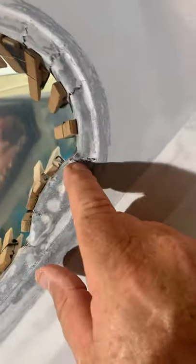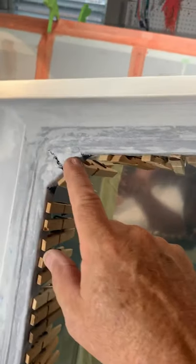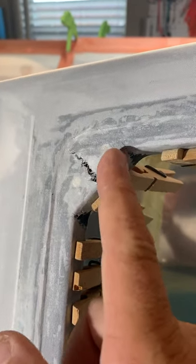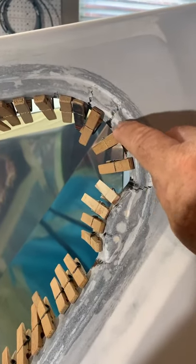When we put this patch on, we've made all these cuts so there's still some bare carbon fiber. When you put the patch on, you'll have to do it exactly the same — it's a solid piece that comes across, you polybrush it on, let it dry, then cut it and do the exact same thing as you did with this. When you make your cuts here, make the cut at a different angle, so when you fold the fabric over from the patch it covers these spots. That way these areas not covered before will be covered with fabric from the patch.